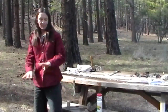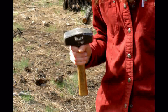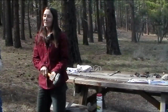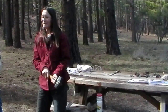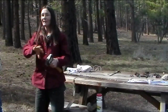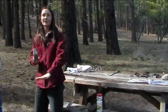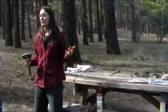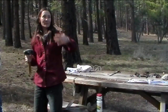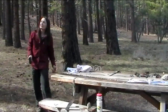But I did find that if I lay a piece of particle board on my cement floor and get a nice little three or four pound engineer's hammer that hasn't been used to hit rocks, and I hammer on those lumps and then check with a straight edge, I can usually straighten them out pretty well. People who've done auto body work like to go on about how the side you hammer is stretching, so maybe you want to hammer the divot instead of the bump — but when you're working on soft particle board you can hammer the bump and it'll push it down into the board. This is not the way you'd do it if you were hired as the saw doctor at a sawmill, but it works pretty well and it's affordable. I've been able to straighten out some really badly kinked and bent saws with particle board, a three-pound hammer, my straight edges, the nail in the garage, and a sharpie pen.